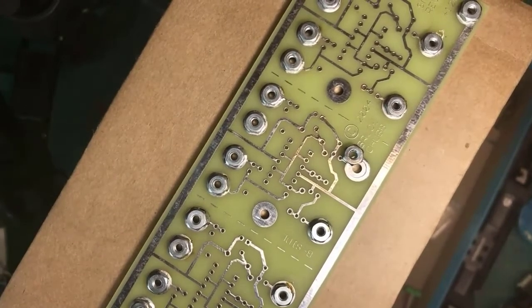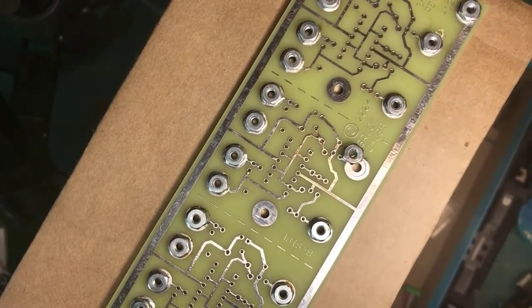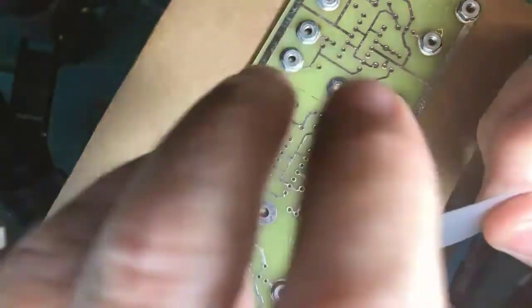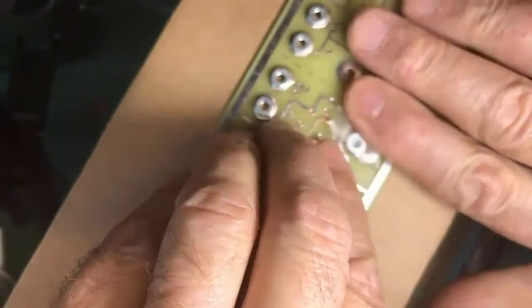The other question is, how many soldering irons do people have? So I actually have two. I have a gun style for big jobs that have to heat. And then I have an electronics temperature controlled one with a temperature gauge where you set it based on what solder you're using. Now, your gun, sir, how many watts is that gun?